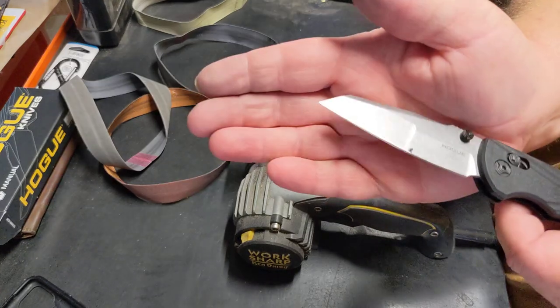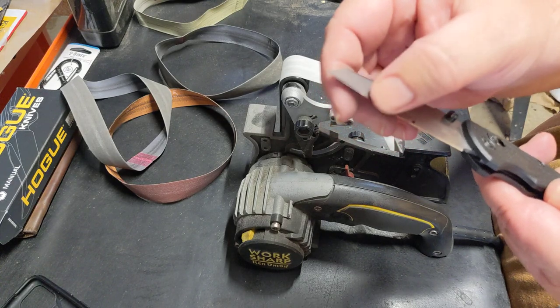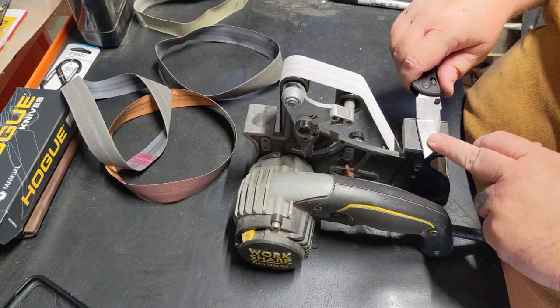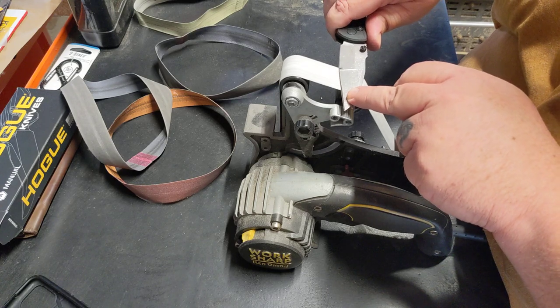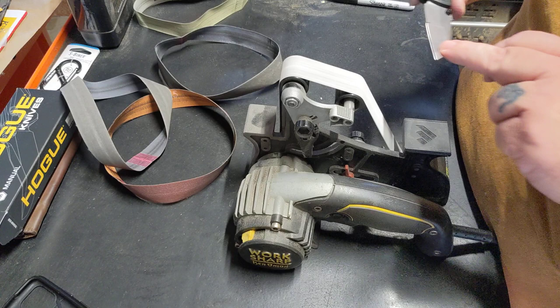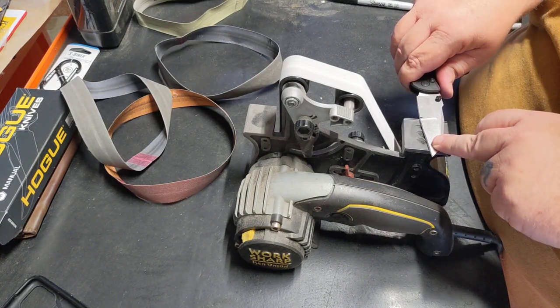now looking at this, I still have a bevel on this side. Or not a bevel, a wire, I keep calling it a bevel. So that's where I'm gonna start, because I'm gonna knock that wire down on that side, even though I normally like to sharpen left. I'll just start this way. Pull the little wire back up that way. Do it one more time, nice and even.